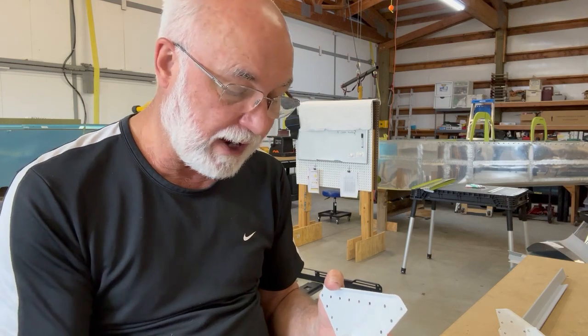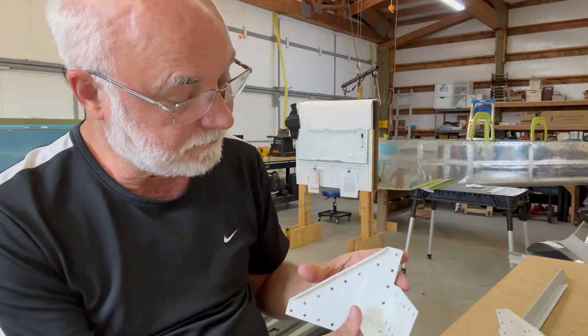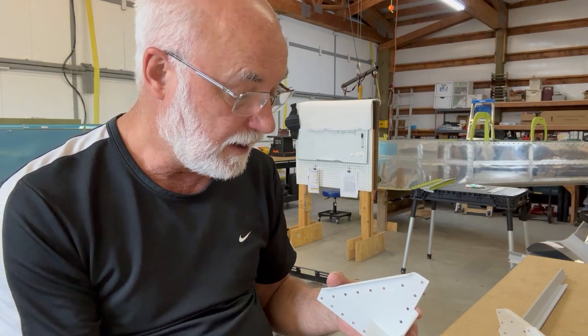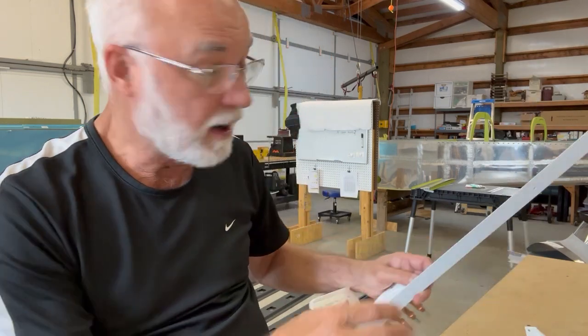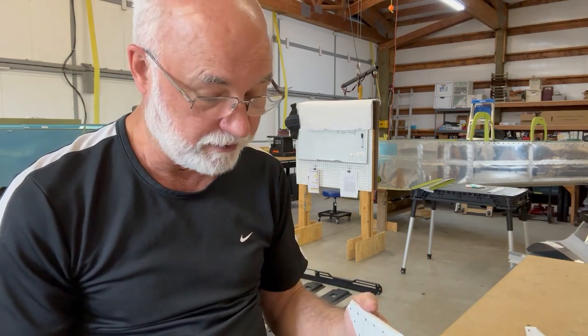And in the process of drilling out the old rivets so I could put new ones in, I misdrilled them terribly. I got, you know, like figure eights on there, and kind of been debating. Finally moved it up to Oregon and got a hangar, and now I could spend more time and do it right. And so the solution was to put in new lower engine mounts and new longerons. And so I made those. Pretty simple. Actually, I spent a lot more time thinking about how to make the old ones work.